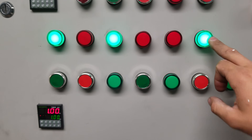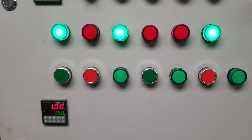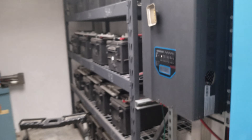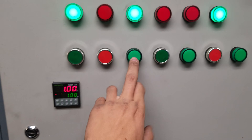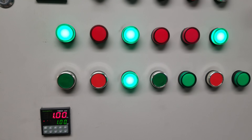So those are all lit up by the PLC, and all the timing and stuff is a drum within the PLC. Now you can see the light's on — you may have heard the clunk, that's that 50 amp contactor closing. Now this kicks in and is charging the battery. A few seconds later the exhaust fan kicks in and now it's fully running. You can see this light for the exhaust fan is blinking, showing that it was automatically controlled.